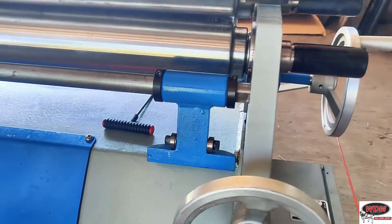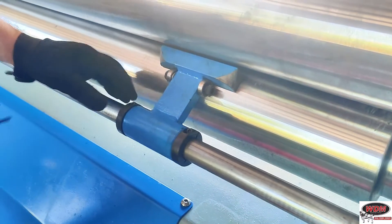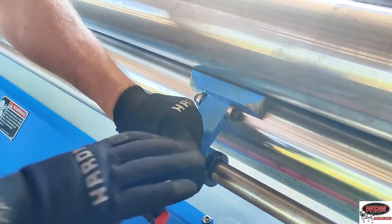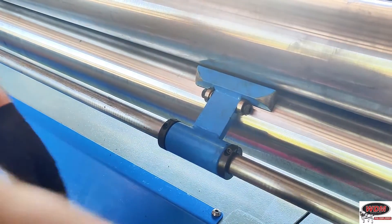I'll put some links to a calculator in the description. Now you have your cone blank and your machine has the capacity. For the rolling procedure: the first thing you want to do is position the cone attachment snubber — it's a little blue block that your cone blank is going to skid against on the inside diameter. You want it to be as close to the drop-in side as possible for the tightest cone diameter. Depending on your cone size you may not be able to take it all the way to the end. Once it's in place, use an Allen wrench to secure the set screws on the clamps and make sure it's firmly set.